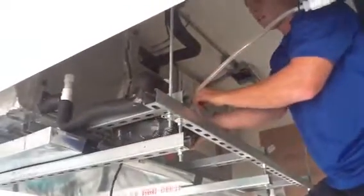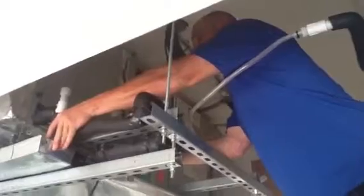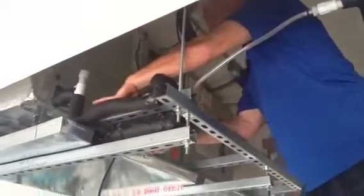They allow that to pass here in southwest Florida. Zach's going to get ready to set this up to level. One thing he does — he knocks out a plug on the back side of the condensate pump so it can be tested for flow. We'll test it in just a few moments. Right now we're just replacing it so we don't have to reroute the insulation line on the condensate.